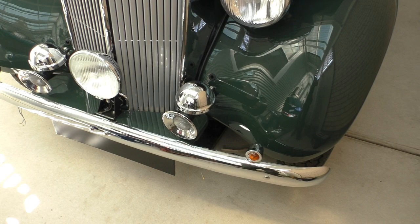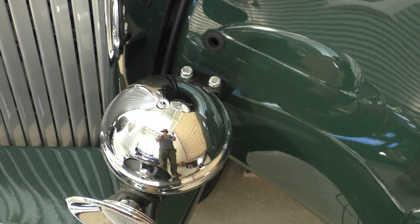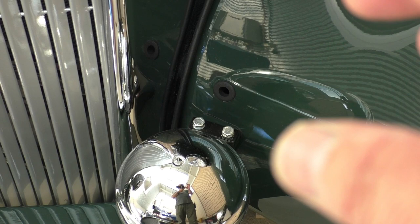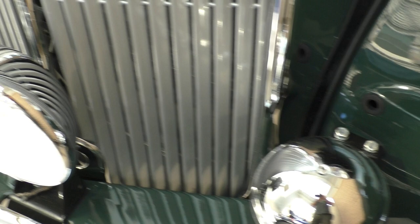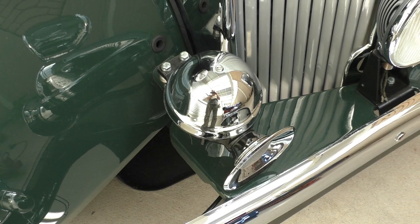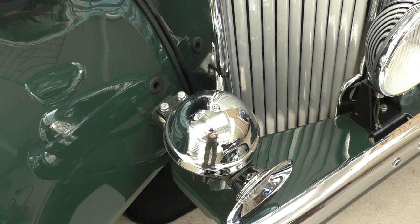The task I set myself today is to do a bit of final fitment work on the horns. One problem I have is one of the tapped holes on this side seems to be stripped, so I'm going to have to take the horn off, take that mounting plinth off, and insert a helicoil. Here's my little helicoil kit for a quarter BSF helicoil. Then as I come to the other side, for some reason this horn sits lower than the other side - too low - so I'm going to make a packer so that it sits at more or less the same height as the horn on the other side.